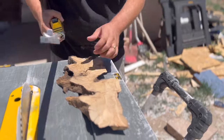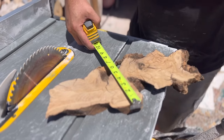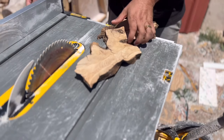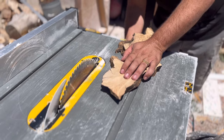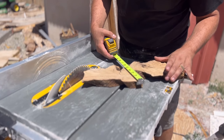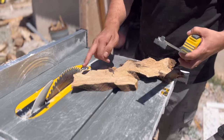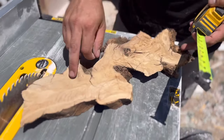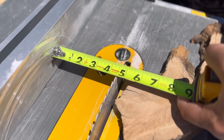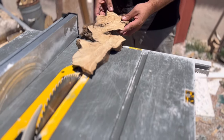We have 19 inches here, so this is perfect. What we need to do is square this up — we've got seven and a half inches here, so we're going to have to cut a little bit of this edge off, and then we'll cut one right down the line. So let's cut first and foremost. We're going to go four inches to cut this straight down the middle, folks, then we should be able to place this in the form in two sections. So let's go four and a half — here's how we measure it right there at that inside edge. We'll lock it in place and get it ready.